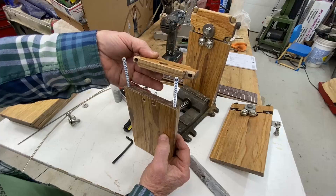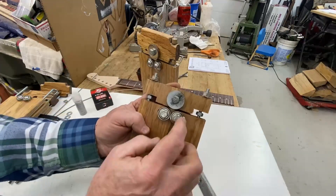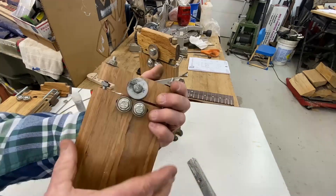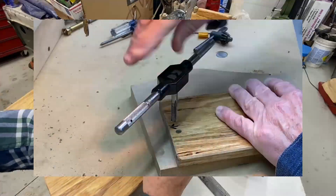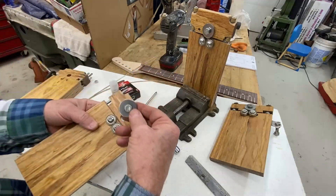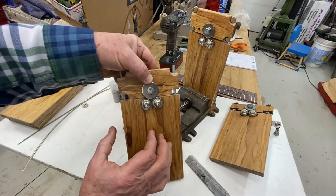These rods are three inches long, and this top half is made to slip right over that. These two holes are for the lower bearings. On the original one I made, I really did not know the spacing of these bottom two to get the proper bend. So you can see these original holes I did — it was too far apart. It wouldn't bend. These lower bearings — these holes are drilled and tapped for 5 sixteenths bolts, and they're 7 eighths apart.